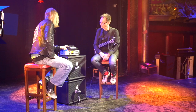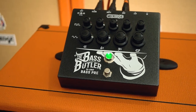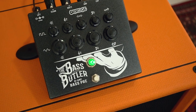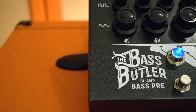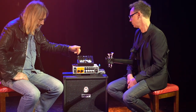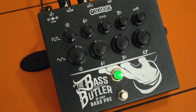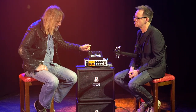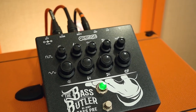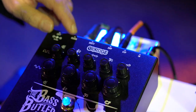So you've got a bass channel, which has compression that doubles up as input gain, bass, treble, and then volume for the bass channel — that's always in. When it's lit blue, the top is muted. When it's lit green, the top is in. The top is a guitar gain structure, basically — a full guitar amp gain structure done with single-ended J-fets. So you've got your gain, bass, middle, treble — like a guitar tone stack. Then you've got your volume and power at this end.